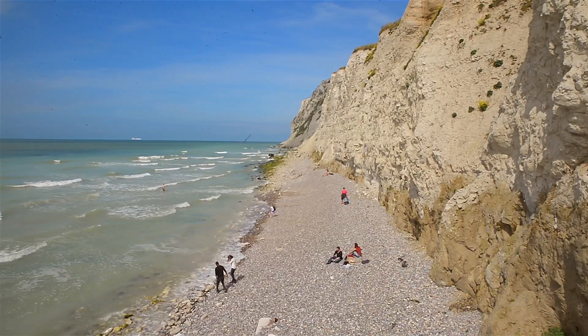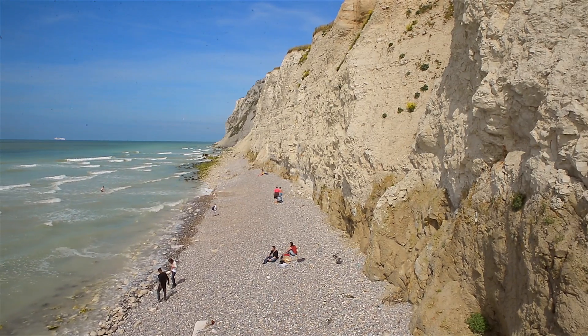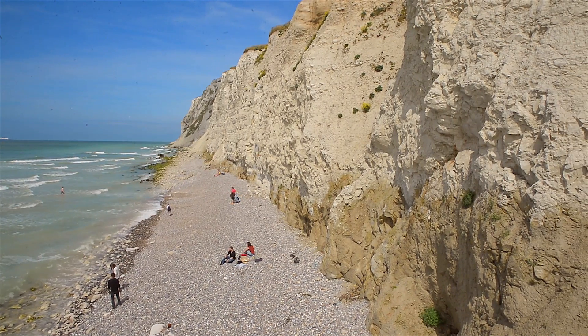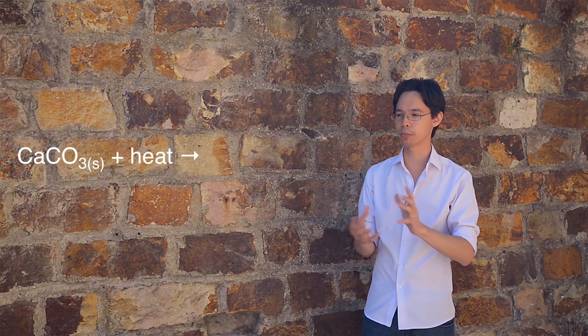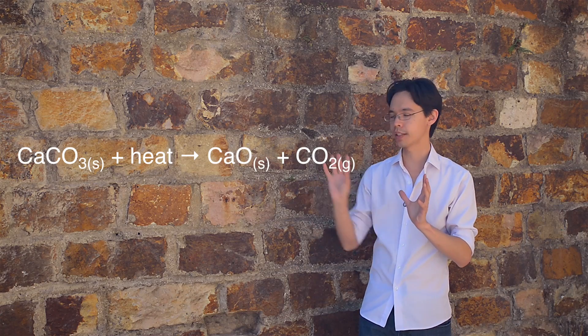The main part of the cement mixture which makes it go hard and set is lime. Lime comes from limestone. When we were in France we found an entire shoreline covered with limestone and chalk. It turns out if you take some of that and cook it in an oven at about 800-something degrees Celsius long enough, it will actually decompose the limestone — calcium carbonate — into calcium oxide and carbon dioxide.